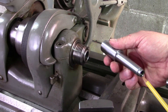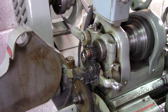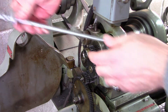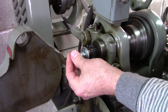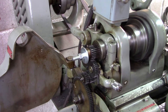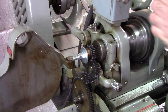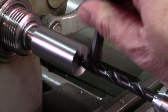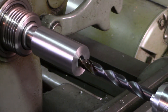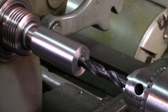Now that I've got the hole drilled and tapped for the drawbar, I'm going to turn the end mill holder around and insert it into the spindle of my lathe. To prevent it from working loose from the taper, I've got a piece of all-thread with a couple of fender washers and a pair of hex nuts. I'll pass that through the spindle, thread it into the end of the holder, and tighten it down — that should hold it in place while I drill and ream the hole at the other end. I drill in two stages again, stopping with a 23/64 inch drill bit, which leaves just about a 64th of material to clean up with the reamer.